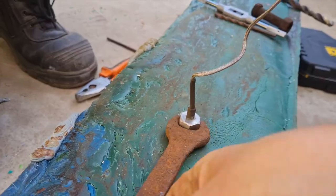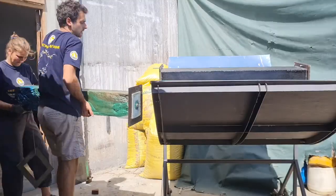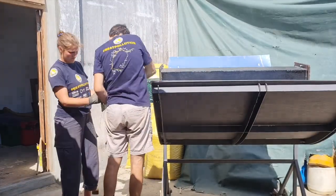Now the other thing we tried is to see if we could reheat these parts up to a temperature where we could then bend them. Now in this test, we weren't able to reach a temperature that was suitable for bending at this scale. So unfortunately, the bending via just solar has been disproved. Although that doesn't mean the solar module won't work for anything. It definitely works for keeping our molds hot while we inject our parts. And that's something super valuable, because keeping our molds hot is going to be absolutely critical for building some of these really big parts for this boat.